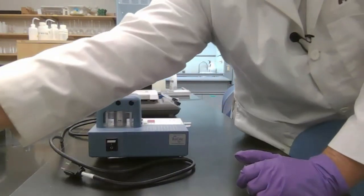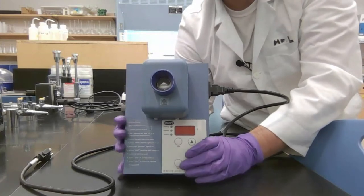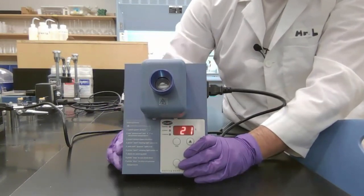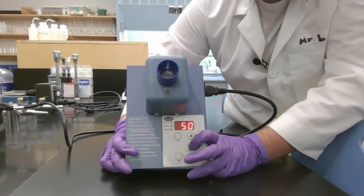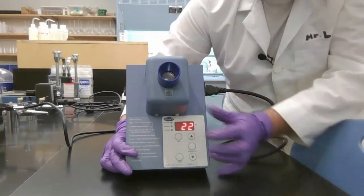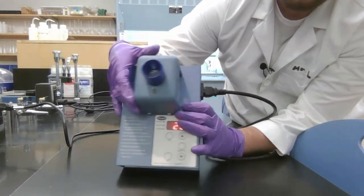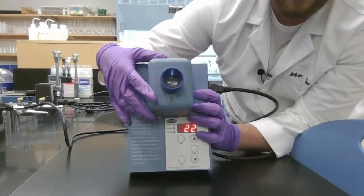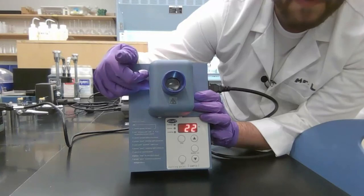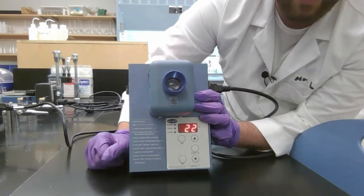Next is the melt temp device, used for detecting the melting point of a substance. You plug it in, set a plateau temperature — say 50°C — and push start. You fill a little capillary tube with your crystals, insert it into one of the holes, and view the crystals. Once it reaches 50°C, you check if it melted. If it didn't, ramp it higher until the substance turns to a liquid, and you've run your melting point analysis.